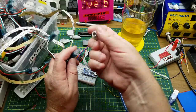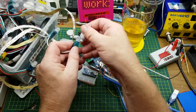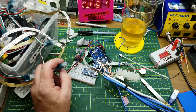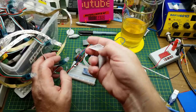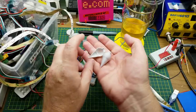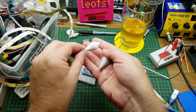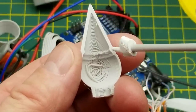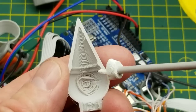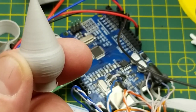Striking a balance between thin enough on the upper part that the LED can actually shine through, and both thick enough and the right diameter on the bottom to actually slip over this thing. I've been trying both FreeCAD and OpenSCAD — that's the OpenSCAD version. I pushed it down halfway through the bed in the slicer so it would print a cutaway version, just so I could see what was going on inside. As you can see, it gets quite a bit thicker in there, and that made a dark band which didn't shine through and make a pleasing light. Plus there's this ugly step on the outside — that was just an early experiment.